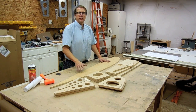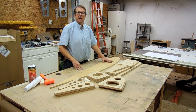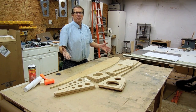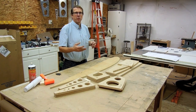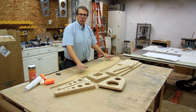In this case I was using half-inch MDF. I take it to the band saw and cut out close to the line, but still leaving the line on the piece of MDF. I then take this piece to a sander — I used a disc sander, a 10-inch disc on my table saw — and sanded it out very precisely to the line.